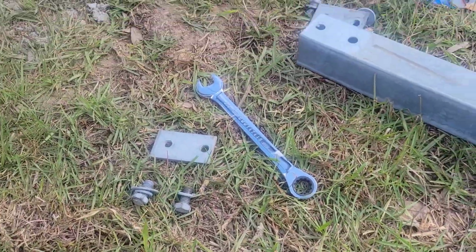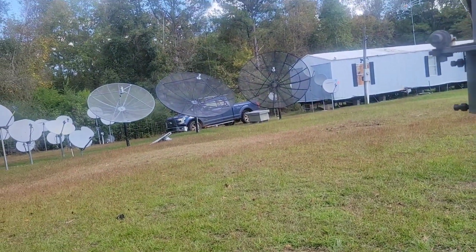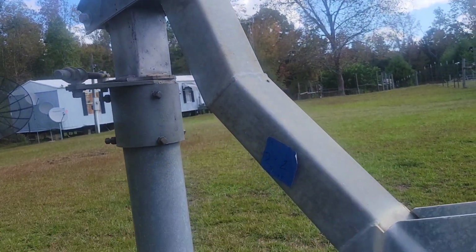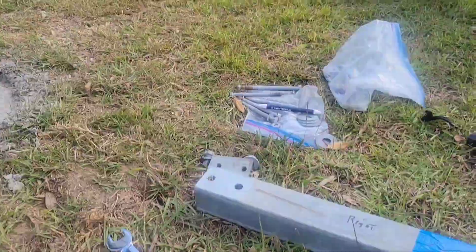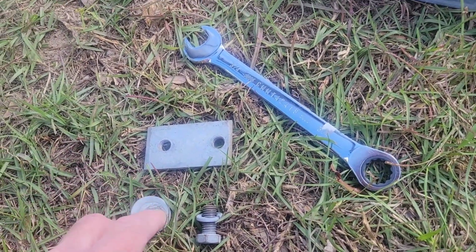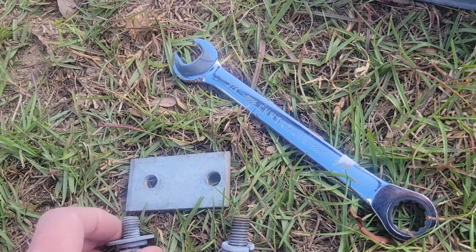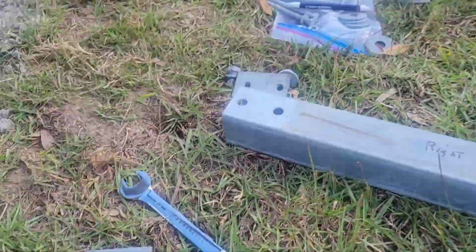So you got to make sure everything matches when you put it all back together, because if you don't, you're going to have a time. Now them over there, they were made commercially. There's no problem with those. But these things here, man, I don't know. When they bought this thing new, they probably paid a bundle for it. But that's the way it is with the commercial machine. Everything's machined, so you have a time getting these bolts in if you don't make sure they're lined up. So my suggestion, I don't know if it's up to you, is put a little A or something on it. Mark everything, because if you don't, it's going to be a hard time. Look at these threads, you can just look at them and tell they're different. Same way here and here, so make sure you get these right.